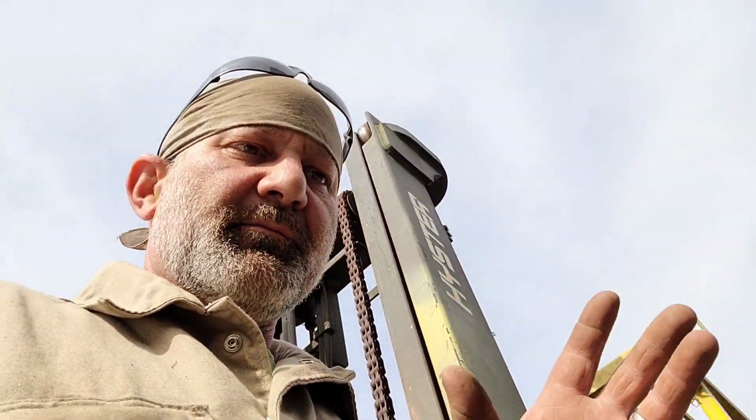There is such thing as metal fatigue. A piece of steel of a certain strength in the past that's been in use and been working, it's not as strong as it was. And the way I describe metal fatigue is, if you want to talk about some of the most resilient steel and the most elastic, forgiving steel you can think of, I would say a 7018 welding rod. Even with a 7018 welding rod, if you take two pairs of pliers and put a pair in each hand and grab that welding rod, you can bend that welding rod until both ends point the same direction, and that rod will look fine. It'll bend a complete 180 degrees and it's fine.